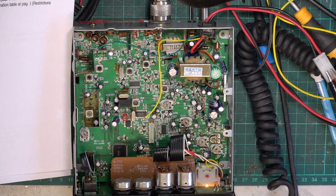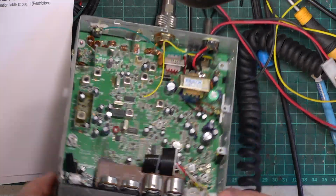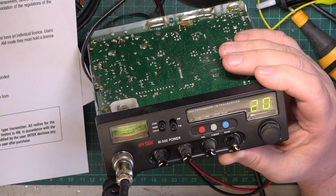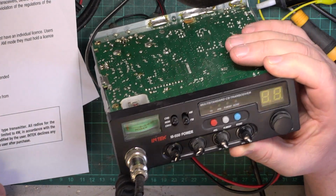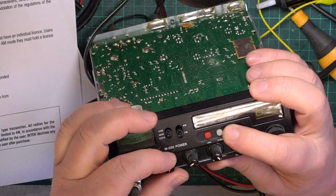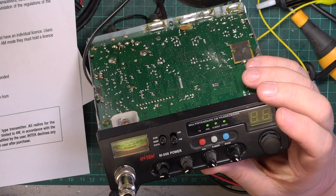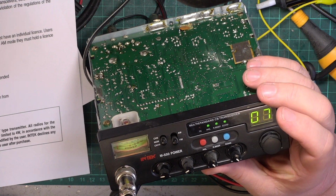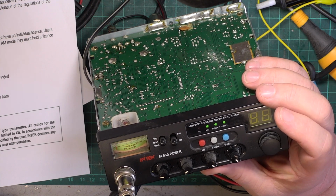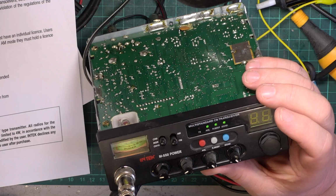So it is a MultiNorm radio, as we kind of expected. And so we'll have to go into this to do the AM side of things. Turn off the radio. Press the echo key and then turn on. The current frequency band will blink. Now select the desired frequency band from the knob and then press the echo key. So I think we're going to need it to do something which is going to do AM and FM. Spain 01.